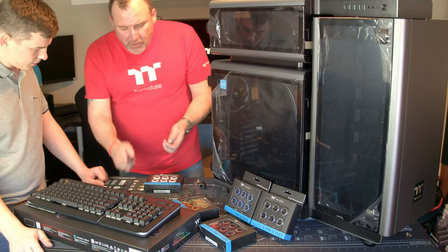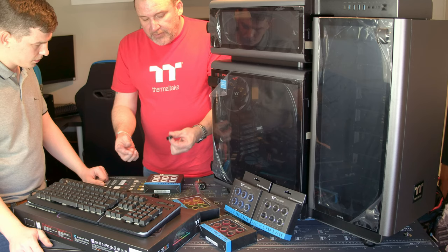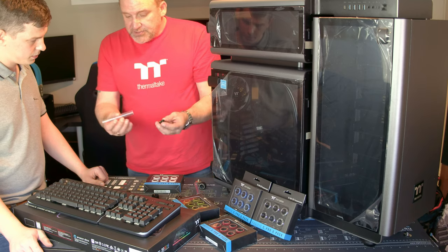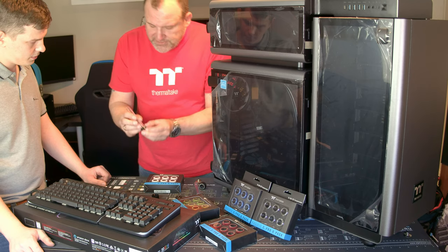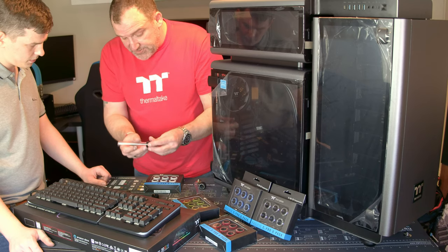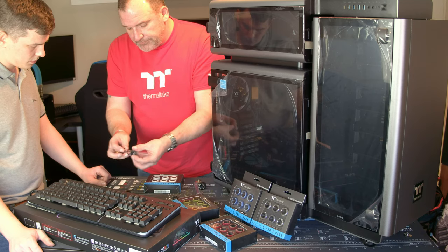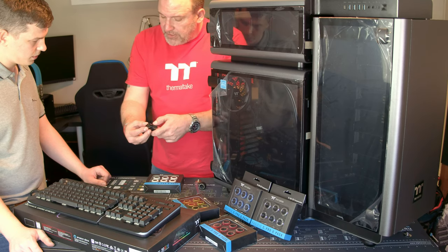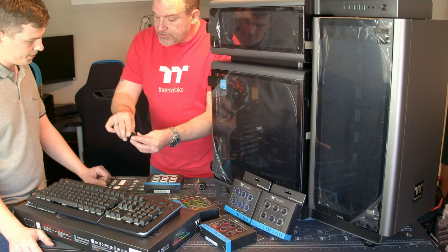So with the C Pro fittings, they come in three parts. You've got your base plate, which has an O-ring on there. Then we have the collar. This collar has three O-rings inside. You've got your chamfered tube, everything's cut to length. Push your collar over and just give it a tap on the table so the end of the tube becomes flush with the end of the collar. Your base plate is then attached to your product. Over the top is your O-ring, and then your clamping ring. You then go into your part. You've got no way of misaligning this. It won't thread on if it's not aligned. So if you're out of alignment, your collar's not going to thread on.